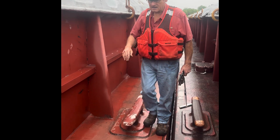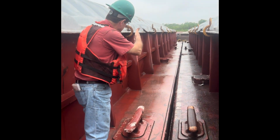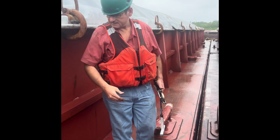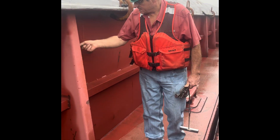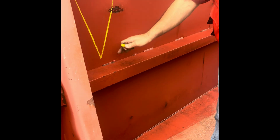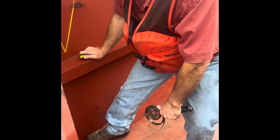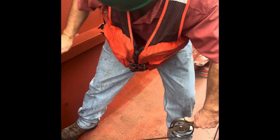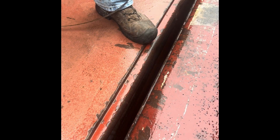Now, in this case, I'm going to simply look. I see 3 tanks that way, 2 tanks that way. So I'm going to go where I got 3 tanks, and I'm going to put me a V right up here on the wall. The point of this V should point to our draft mark. The purpose of that V, if this mark gets rubbed off or it's gone, when they come back and survey the load, they can put their tape right under the point of that V, measure 3 feet, 2 inches across, make a tick mark, and they know that's where the draft is.